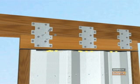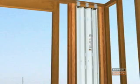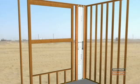Connect the top plates and the shim block on each side of the wall with either LTP4 or A35. Finally, place the minimum two 2x6 full-height studs on each side with 10D nails at 16 inch on center. Understand that the designer determines the actual stud or post design based on out-of-plane wind loading. This is what the balloon framing should look like when it is properly installed on a concrete foundation.